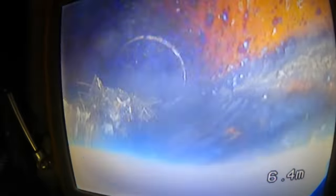We got mega roots up there. It's nicely blocked there as well. That'll be servicing the laundry, I'd say. All right, so that all needs to be jetted out, and then we'll do the toilet paper test. But first, I think we'll start on the inside bathroom, pull out the toilet, have a gander with the camera from there, see what we're dealing with, and blast out the roots if there's roots in there.